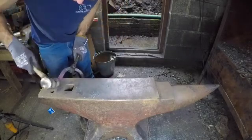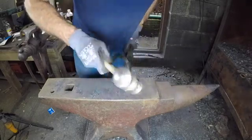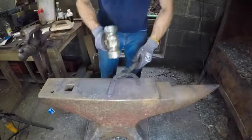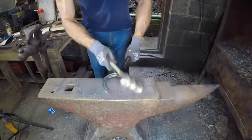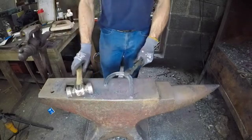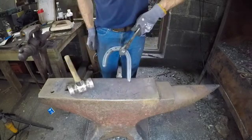Finish the heel off and make sure there are no sharp edges. You're still looking for two thirds, one third. Flatten the heel without crushing it — one of the most common mistakes is to overwork the concave section. If you get a bit of distortion on the foot surface from the safing off, you can close it up. You're still looking for the two thirds, one third, lovely rounded, safe heel.